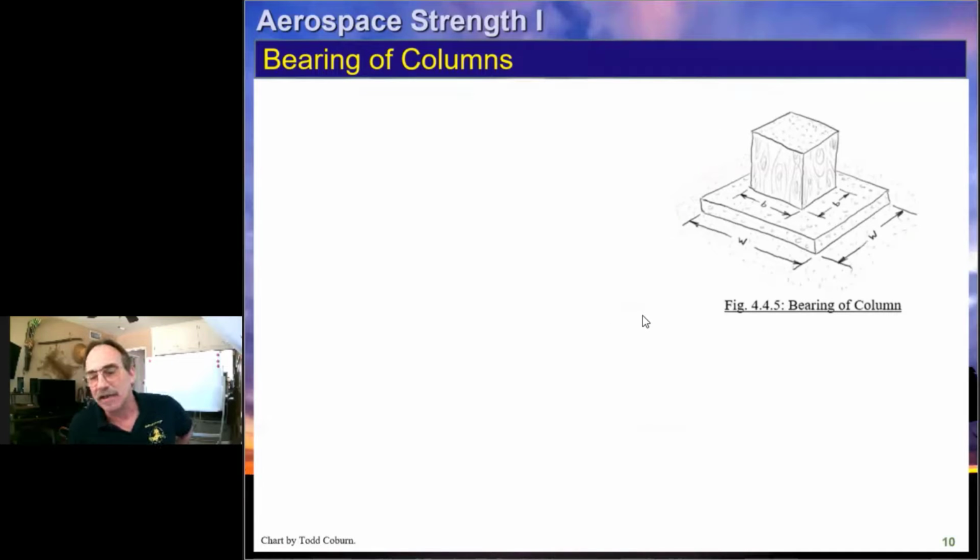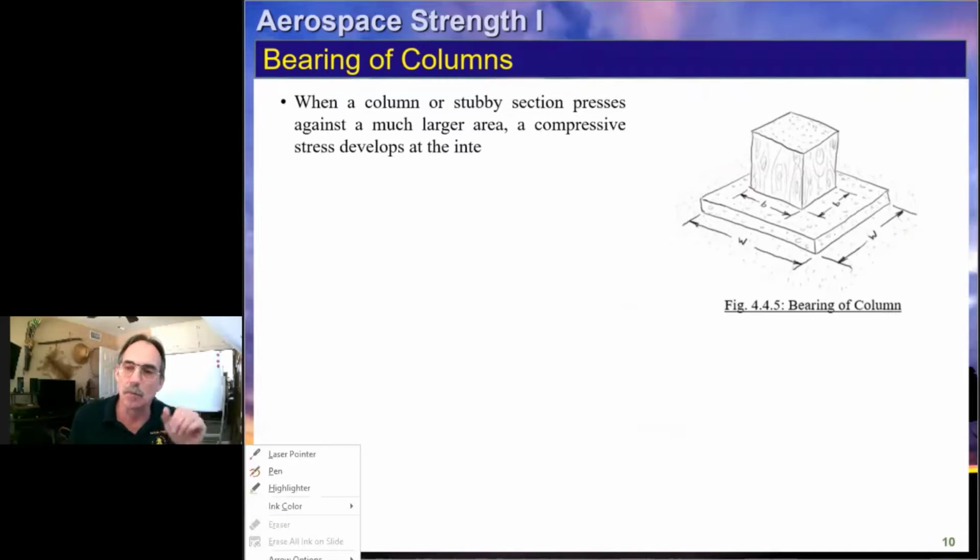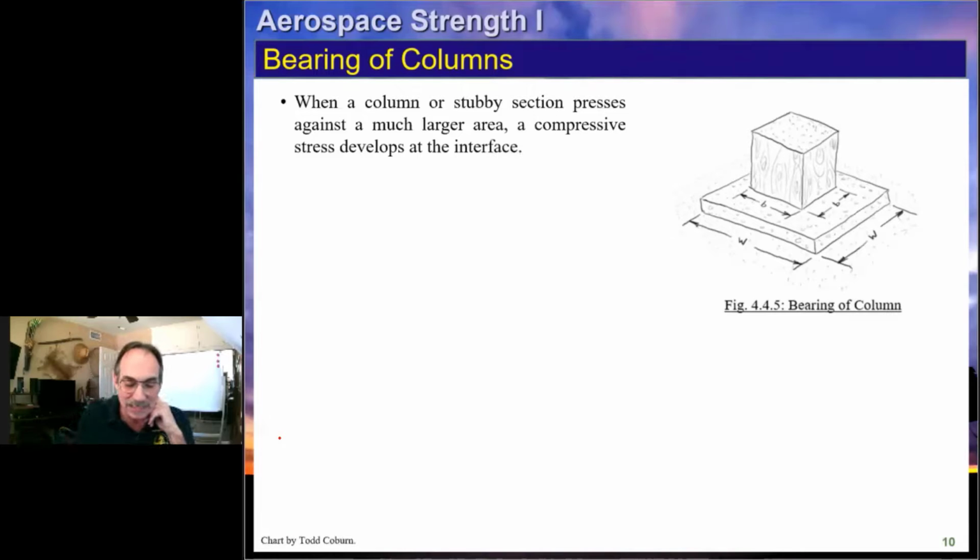Here's another little bearing. Now we saw a very specific meaning for what the bearing stress means, but let's look at a different thing. Let's say that you're designing your patio and you have a post that's sitting on a concrete slab that's sitting on the earth. You can see that means you're going to get a force acting down on this post. And the stress on that, that's a normal stress, is just P over A. So typically we would just compare that to FCU of the material. And that's valid for a member like this with known dimensions.